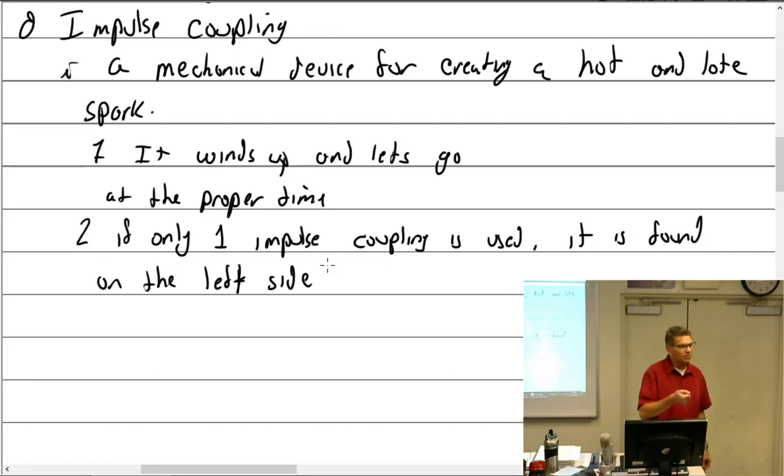If I try and start my aircraft and both magnetos are on, what's going to happen when the right one, if it does spark, is coming up? Isn't the timing going to be off? Timing's going to be off. It's going to fire it at the advanced position and kick everything back down. So you guys have seen the Bendix. Those things will actually fire pretty slow. So you've got to turn off the non-impulsed one and let the impulse go.